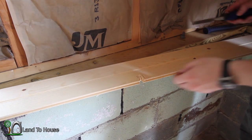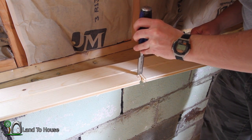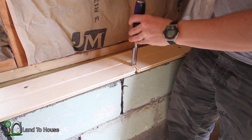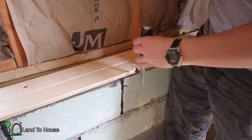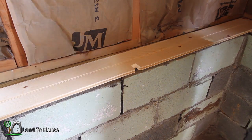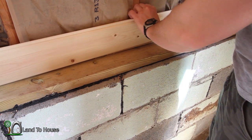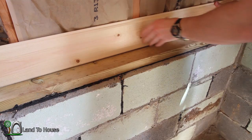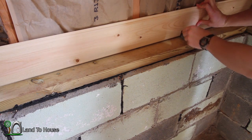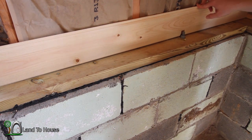Well, I took the circular saw and set it to the depth that I wanted, and then I just cut out several little notches here in hopes that I can use the chisel to carefully knock this out of here. Yeah, just like that. So now let's see how well this thing fits in here. Dusty. Yeah. I mean, it's not the coolest design ever, but it kind of just compensates for that piece. I think next one I can go a little bit shallower and be just fine.